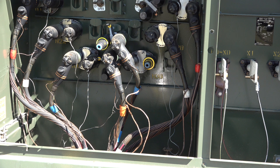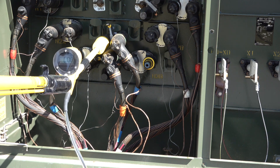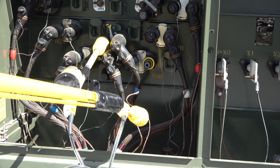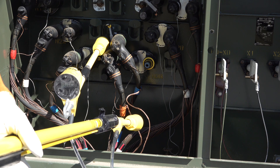Since this cable was good and able to accept the full potential charge, we now need to discharge it. Again, remember we need to use the probe with the high pot connected to source, which is the energized cable. Take the second probe and touch it to ground. Notice the reading on the meter — it will spike high and then go to zero. Now the cable is safe to handle.